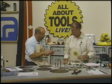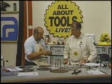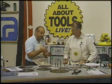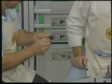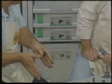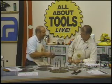But no, actually, don't miss this. The amount that the router bit shank goes into the collet is critical, because you don't want to have this just part in, and you can look at your collet and determine how deep it is, and then just look at your router bit and say this much has to go in order to get the full use of the collet. If you're only using half of the collet, instead of clamping like a parallel clamp, it's going to clamp at the outside, and it's going to be on an angle. So it's not going to have the hold that this does.